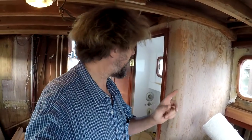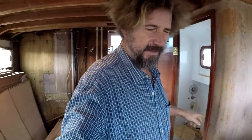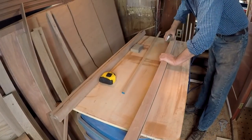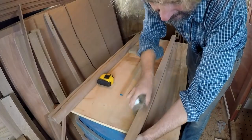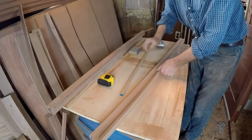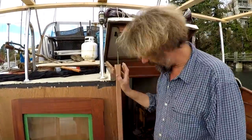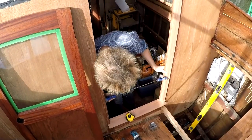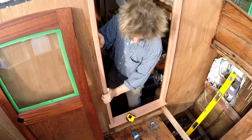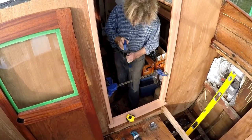Good morning — putting the rest of the door together, another dry day. I just want to mention that I'm just making the frames, and I know it's traditional to have very heavily eased edges on wood on a boat, but I actually like a slightly more crisp edge — I basically only just break it, maybe a sixteenth or less of a radius. So here we have our two frame pieces; the sill piece is already in place. The next few clips had completely unusable audio. I set the two frames in, but before really finishing them I wanted to set the door and make sure everything sat nice and square before I put too much investment into those side frames. That requires gaining out hinges for the door and screwing it into the bulkhead.